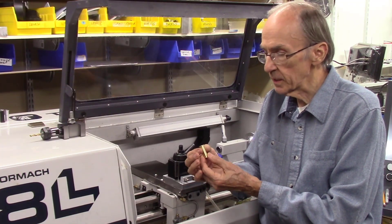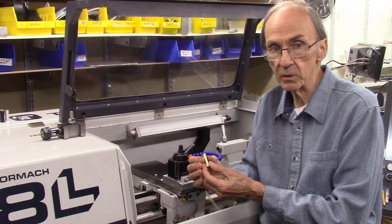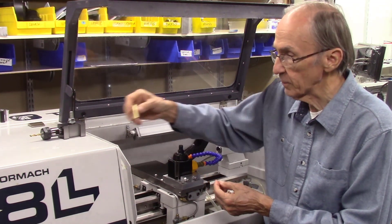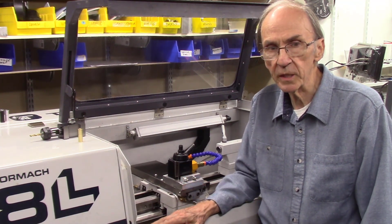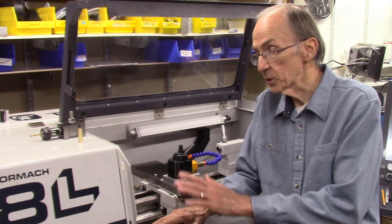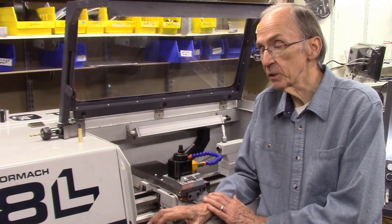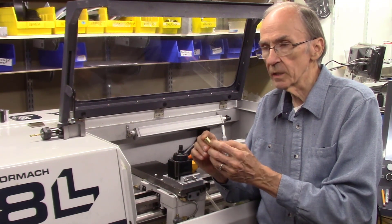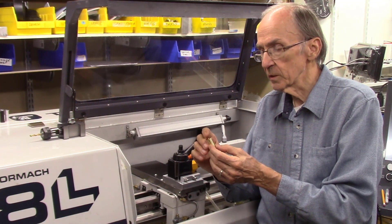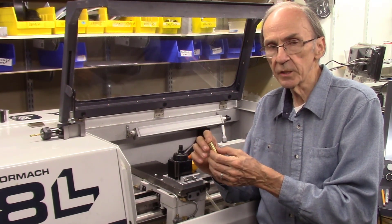The system was quite precise in machining these parts. I was trying to machine these to a diameter of 0.4997 and I was able to get down to 0.4995 plus or minus two tenths. So it's pretty accurate for what I was doing, and I'm quite happy with that. The system is time consuming to set up, but most of that's just due to my inexperience — I'm not only learning the software for the Tormac, but I'm also learning Fusion 360. And Fusion 360 was needed for this project — it was too complicated to do the G-code in conversational programming. I needed to use Fusion 360 to design the piece and then generate the G-code.